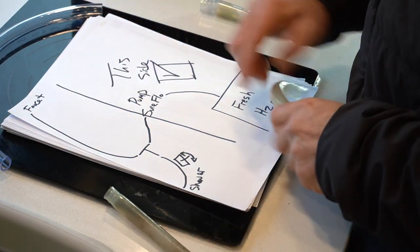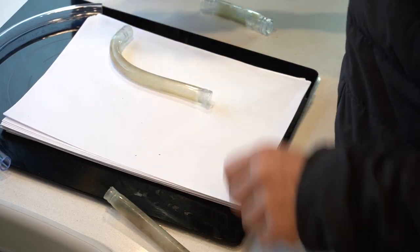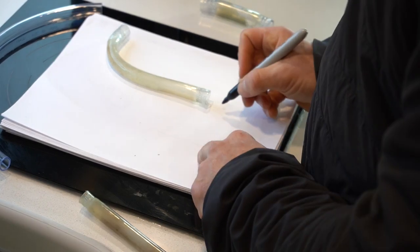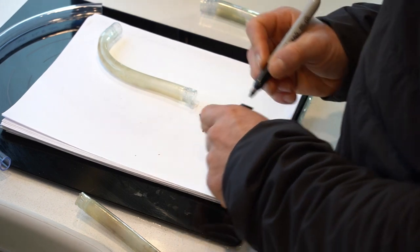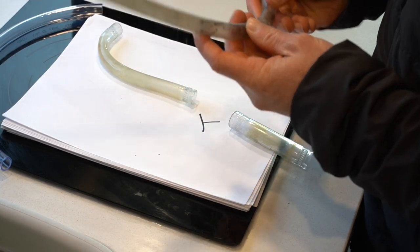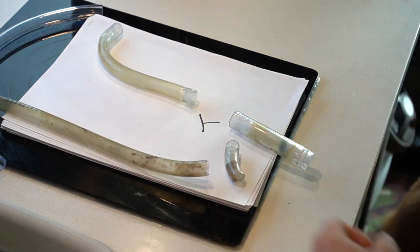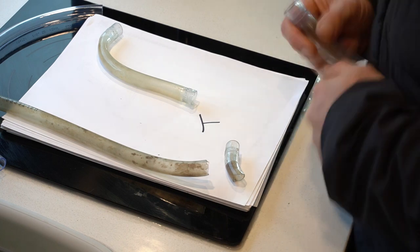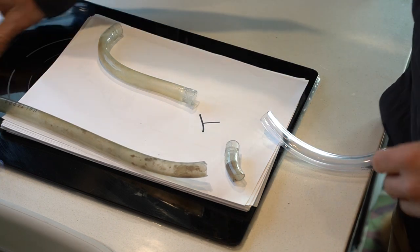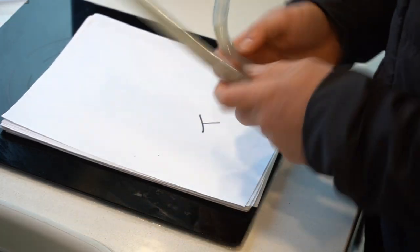From the pump I have this tube going down to the T-joint. Here's our T, and that goes down to the ball valve. Then there's a piece that's a little more curved, and that goes from one side of the T all the way up to the faucet. This is an easier fix than most, but it does require getting into some weird positions. I've got all of these tubes ready — I bought a little extra in case I needed to trim when getting on the pipe clamps.